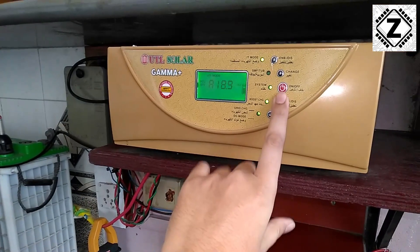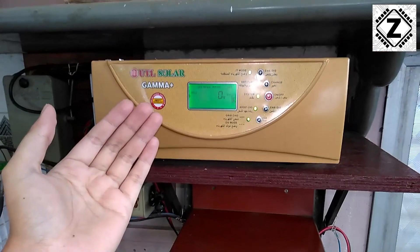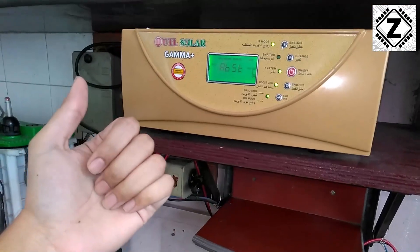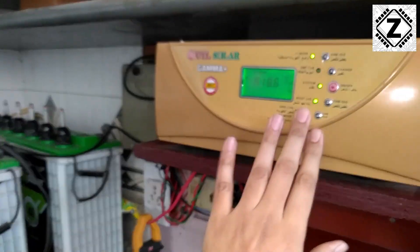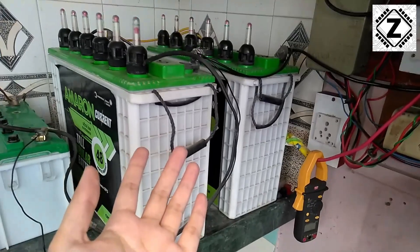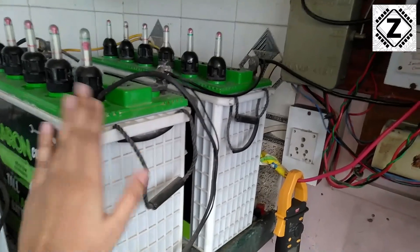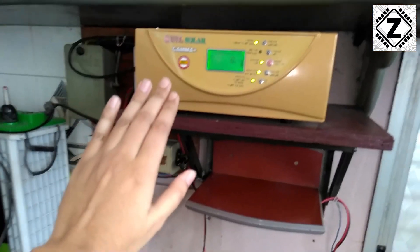The second scenario is when you go on vacation. You turn off your solar inverter or PCU to avoid fire hazards, short circuit hazards, or appliances left running. But if you turn it off, it's very important that it still provides some charging to your battery bank, because in the absence of float charging, batteries will get completely ruined due to sulfation in a matter of weeks.